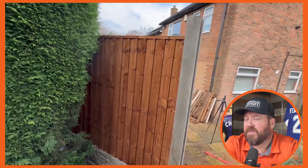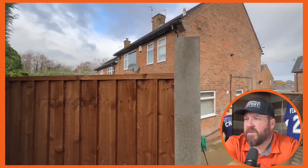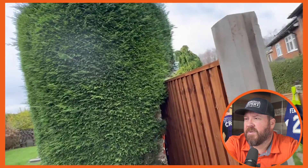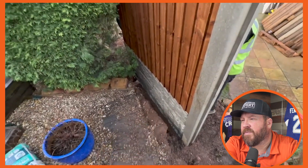What's also interesting — they'll build these section by section. Similar to how we would build an aluminum fence, they would build it section by section. They would set the post, insert what they're calling the gravel boards at the bottom, and then go on the other side, mark their post where it needs to be dug, and dig it out. So they won't actually dig all their posts in the beginning, set posts, and then come back and finish it. Kind of interesting to see another process. Nice and steady on that post because, obviously, it's just set. We're on about six inches — a nice, natural step. Look how tight it is to this conifer — look at how much conifer we'd have to take away. So we've gone with the six-inch option instead.